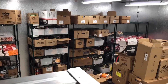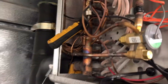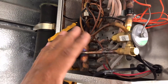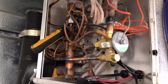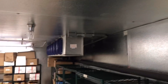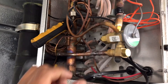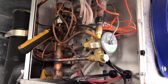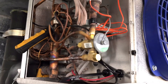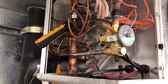We got this one dialed in at about four to five degrees — I consider that perfect. I'm gonna button this up and then verify that other one. This superheat setting is a bit of a waiting game: you adjust a little, wait at least five minutes until it settles in, and if you don't like it you adjust just a little bit — that's just kind of the way it goes.